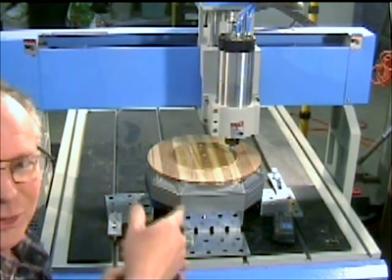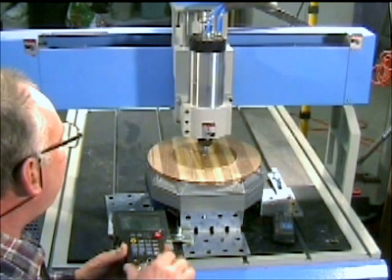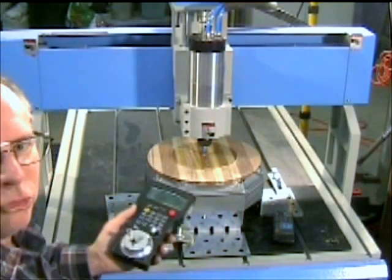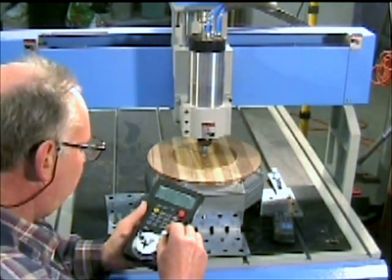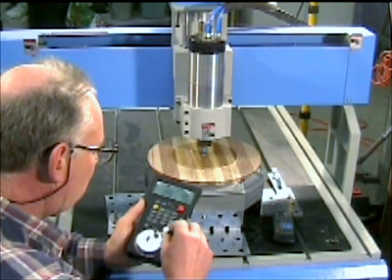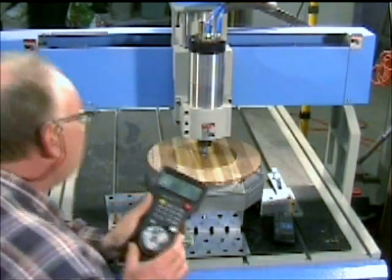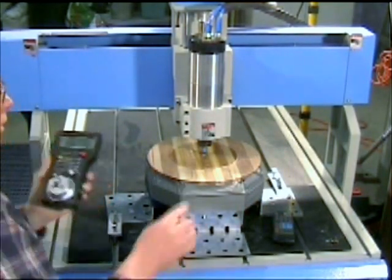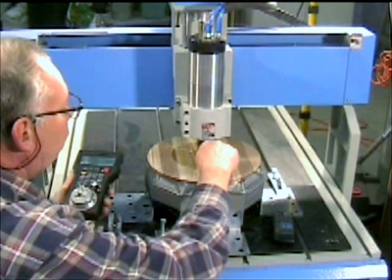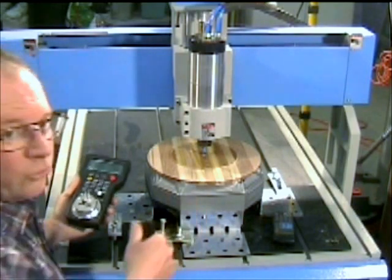Having said that, I hope I don't make a mistake now. Here we go — we'll just center this and zero it. I'm using just a nice pointy tool there to give me a marker. Take it down a little bit, forward. Happy with that. Not only have I got a little pilot hole drilled from the center to indicate the center to me, I've actually got chisel lines on there giving me the center as well.